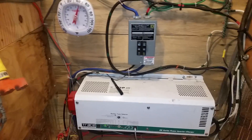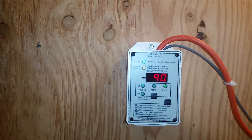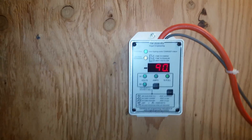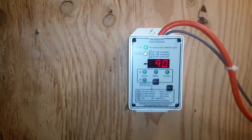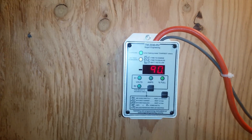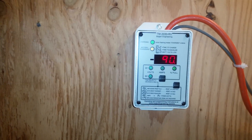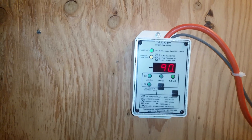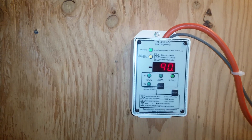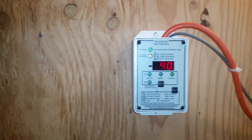When it goes into absorb mode, I turn the diesel generator off. Then I go down and run the gas engine, which only costs $99. Why put the wear and tear on the expensive motor? In absorb mode it runs 6 hours on 0.9 gallons. So I usually get 4 days of finishing off my absorb mode — 4 days in a row out of one gallon. I can bulk my batteries with the diesel generator, usually an hour and a half, and I get 6 to 8 hours run time per gallon on the diesel. So I'm running an hour and a half on the diesel, then anywhere from 1 to 2 hours on the gas engine to finish off the absorb mode.